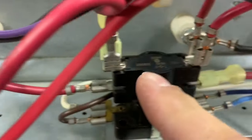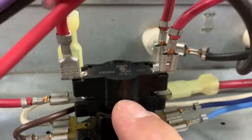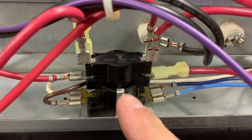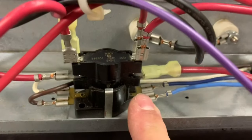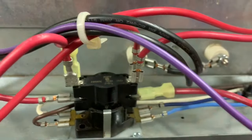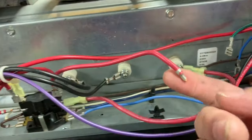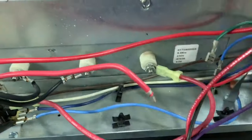Your top sequencer will be your first strip, and it will time-delay another strip. You may have three of these — there may be a whole bunch of wires coming off, but don't get too caught up on that. Take a minute and track where they go and you'll see what they do. A lot of these will have extra wires because some component on the air handler needs 240 volts. Like here, this one has 240 volts coming off it going over to a board on this unit.